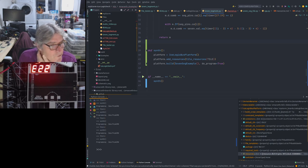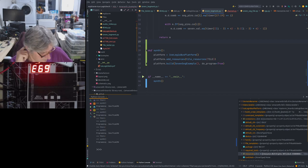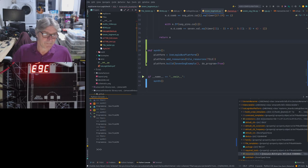Yeah, the Stemma connectors only have four pins, two of which are power, so it's only got two signals, which is a bit limited. But I can do a little adapter board, you know, a blade, a card blade, that has two Stemma connectors on it. You could put three, but I think physically you might have a problem finding the room for three, unless you had them point in different directions. If you had the vertical ones, you could put three, or you could have a combination, two vertical, one right angle, for example.